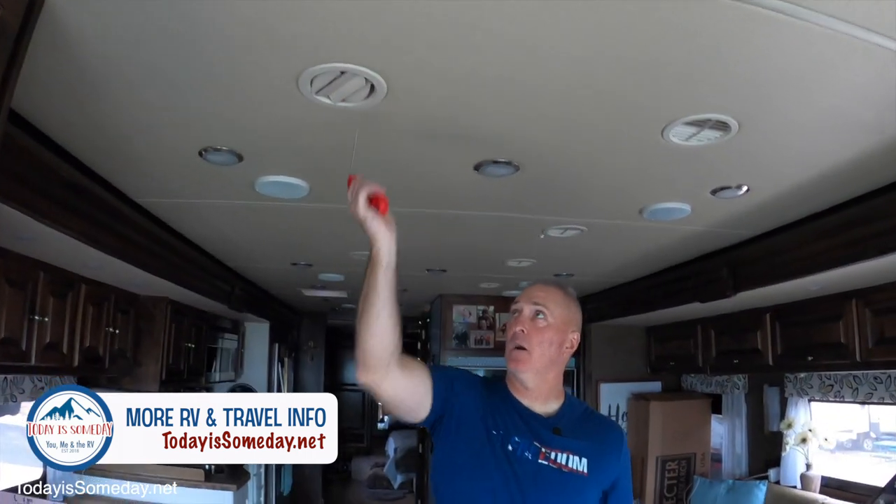After 15 minutes, I got 71.4 degrees Fahrenheit as the air was leaving on the return side. Switching to the supply side nearest to the AC unit — after the second 15 minutes, it read 45.5 degrees of cool air coming out. We're over the 20-degree difference in the delta T, which means these units are pumping pretty well.